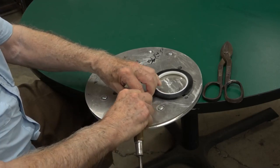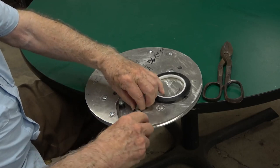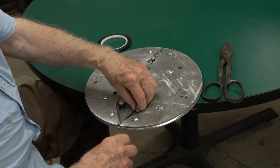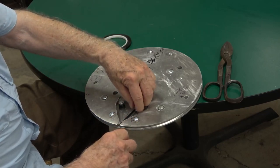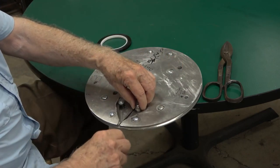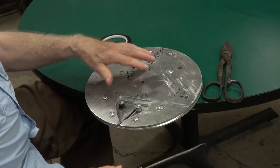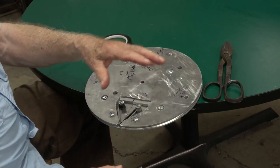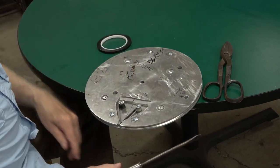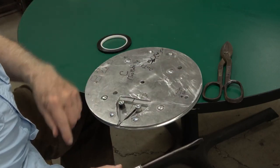And the tape has to be tight all the way around. In this particular example, I have it a little loose, but if you're careful, you can start it on there and wind it up and maintain good tension all the way around. And then you have the tape in place, so the next step would be to take the whole mandrel onto the other structure over there to actually start winding the wires on top of the sticky part of the tape.